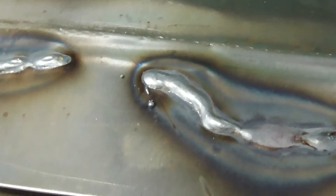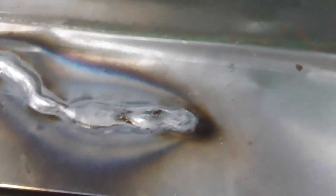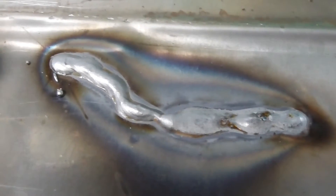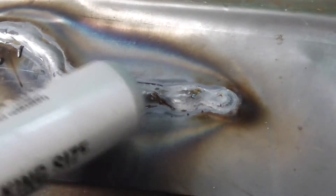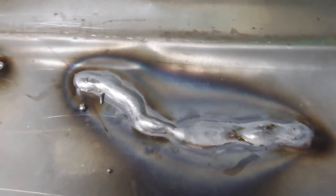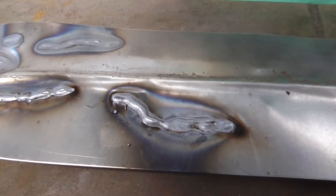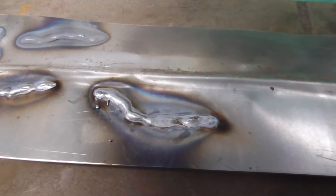What Nicole just welded — same piece of metal, same gas, same wire spool, same MIG gun. You can tell she did the same thing: starting out pretty good, going up really high. For a split second she lost the parameters, but the machine came right back in. The bluing is pretty much consistent, the bead width is way more consistent than the other machine, and it lays down nice and flat.